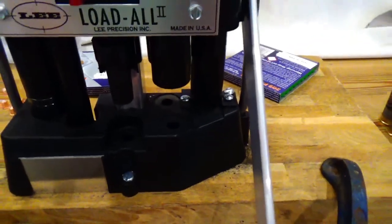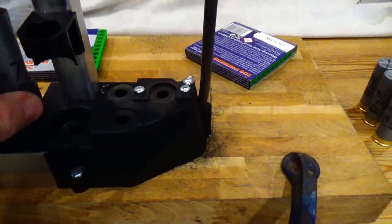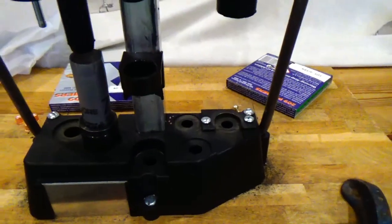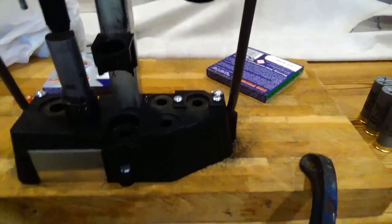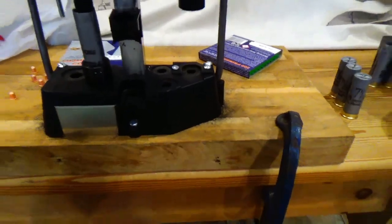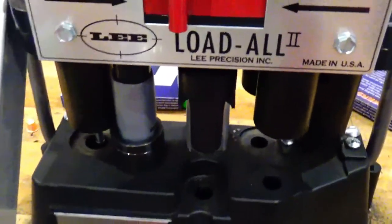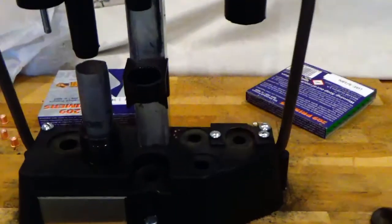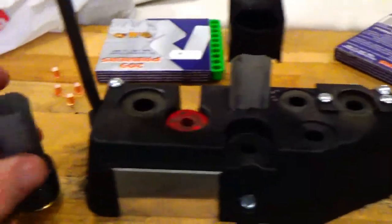Feel resistance there like so. Lift that up. You put it in there, and that first bit of the machine actually knocks out the primer and resizes the old cartridge. Then you put your cartridge in there. Press that down. Hear that go there? Sorry, the camera jumped. That actually puts in a new primer, which I'll show you now. New primer there. So that's been resized.